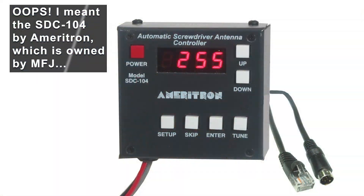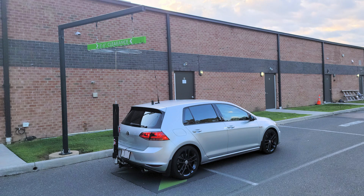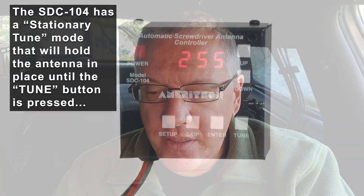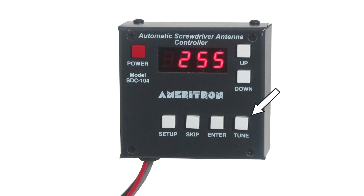It moves the antenna only when I press a button. Sometimes I think about trying the MFJ-104, which is kind of cool because when you switch bands, it will just move the antenna to the band you're working with. But sometimes I don't want that to happen — I'll put my antenna all the way to its lowest position because of where I'm driving, whether it's trees or going through a drive-thru. I want all of my antenna movement to be completely intentional, nothing automated. So I will sometimes move to another band on the radio, listen to see what I hear, and then if something interests me, tune the antenna. Otherwise, I like it to stay still.